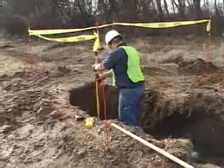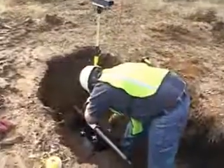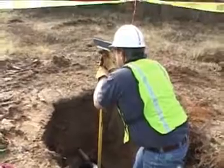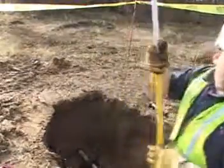Consider the soil conditions on your job site. Some soils, like topsoil and sand, will cause the tool to rise. Compensate by pitching the nose of the tool slightly downward. The amount of downward pitch required depends on the soil type and the length of bore.